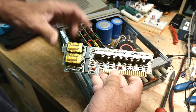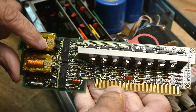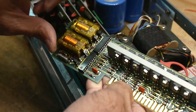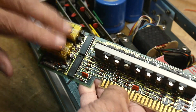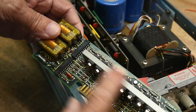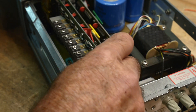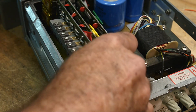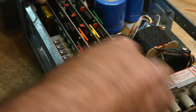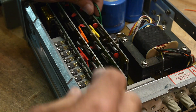On the driver card, the relays are different on this one — these are clear relays from the same Japanese manufacturer, Aromat. The other ones are in solid plastic — not clear. This one also has an aluminum heat sink for the transistors; the other ones have just a plastic spacer. That was probably a cost-driven design change — they decided the transistors weren't getting hot enough to need the aluminum, so they went with cheaper plastic.